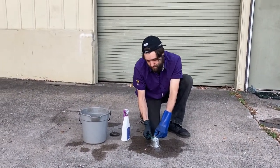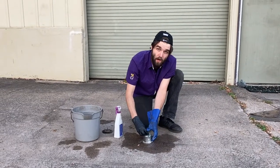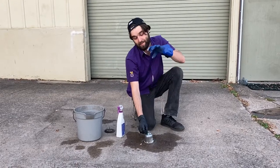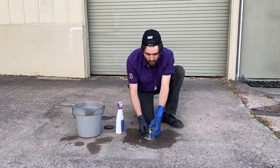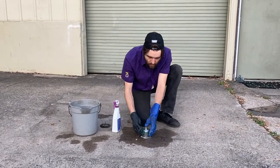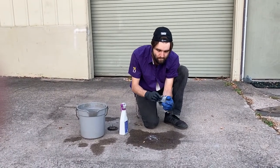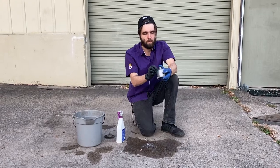Now I'm currently working on the second one. The first one is polished to where I want it and I've dried it off. Shout out to my dad — he's camera-manning right now. Why does one want to dry off wet aluminum? It will continue to oxidize as the water evaporates. When you're done with this process you've stripped all the oils off and you have the aluminum as bright as it's going to get, and it's in a raw state so it's going to start oxidizing immediately.